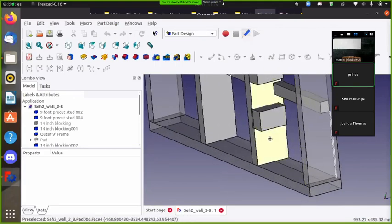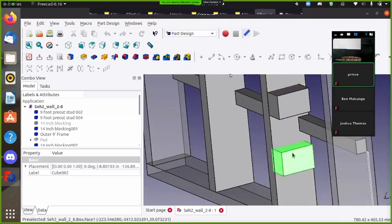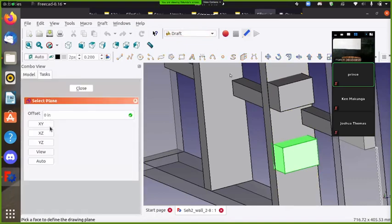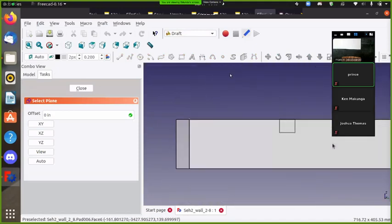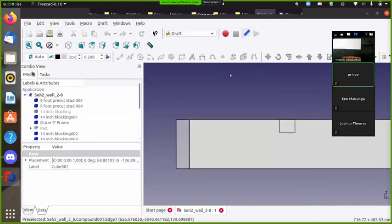Taking those so they're vertical rather. Oh, I see. This needs to be rotated. Okay, so how do you rotate? Get into one plane. Select one plane. So hold on. View it from a place that's easy to manipulate, like 1, 2, 3, or 4 on your screen. See, that's two. So you want to hide the rest or make everything transparent so you can see where you are.